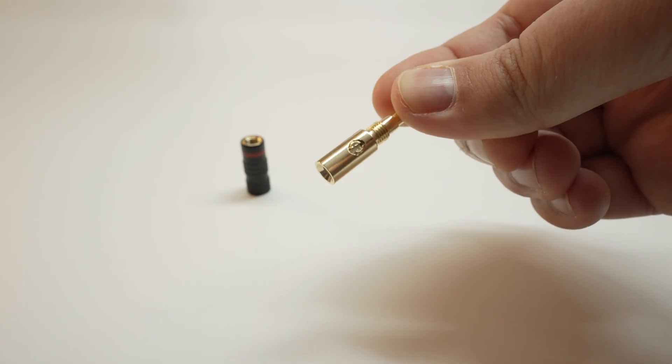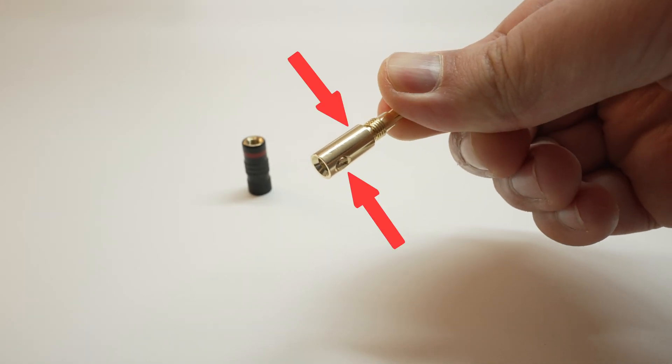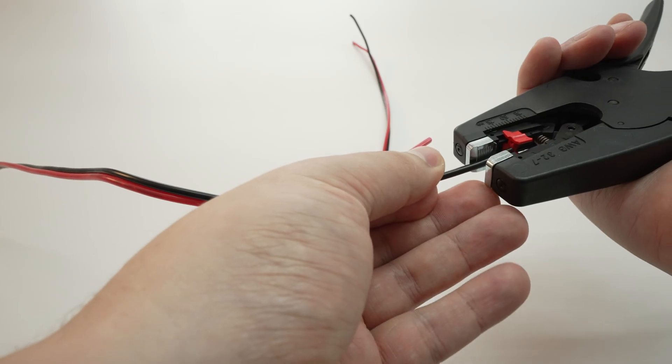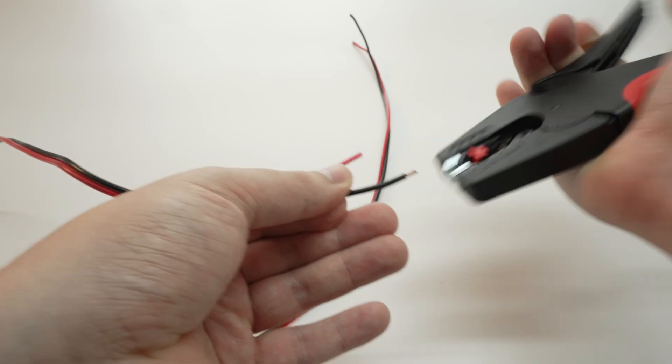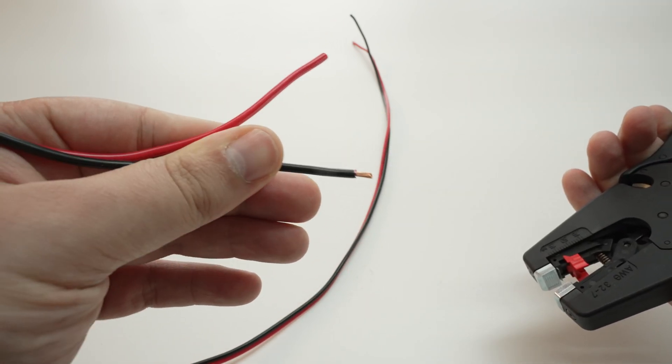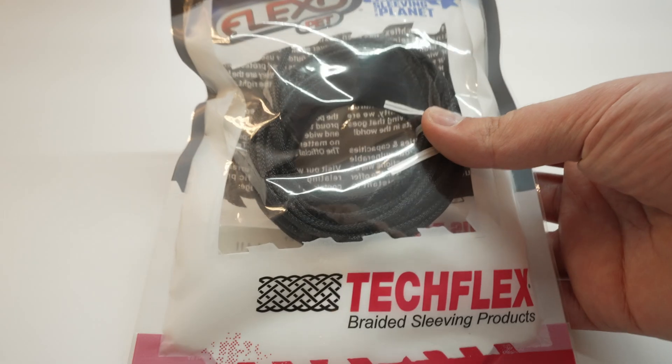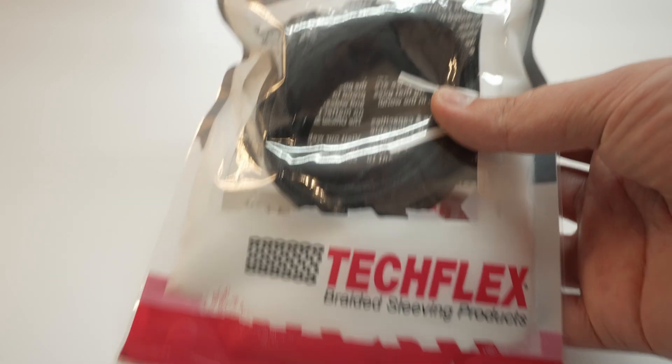However, there is an issue with this. You can see how the screws are placed on opposite sides — in this case I cannot use a ferrule and grab the conductor with both screws. It won't work; the wire needs to bend too much and the ferrule will prevent that. In this case, we will expose just 6mm of conductor, apply the ferrule and snip the hollow end.